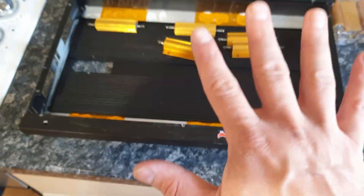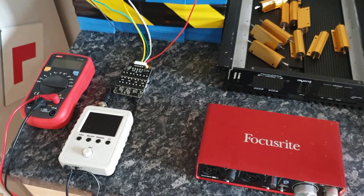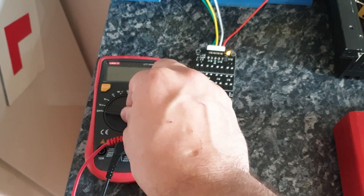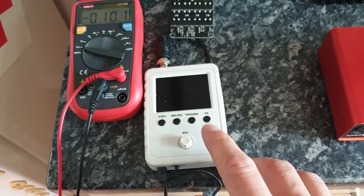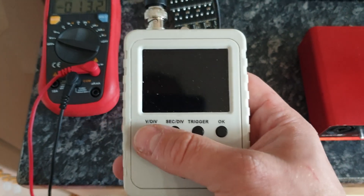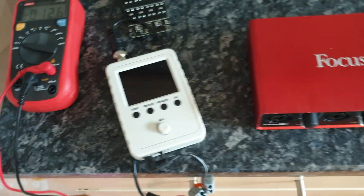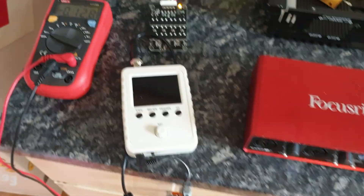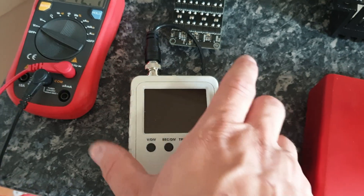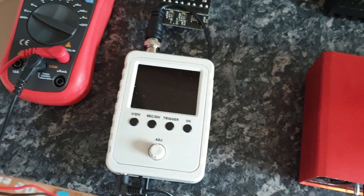So this is my load bank. The other tools I might use: just a regular multimeter to measure voltage, and then I might use a scope — this is the cheapest one that everybody buys and it's plenty good enough for this. These measurements are just for checking amplifier clipping and checking the sine wave. I might use REW for that, but this is just a handheld scope — I paid 20 pounds for it and it works perfectly.